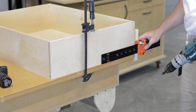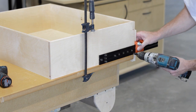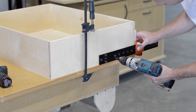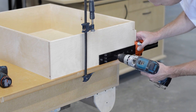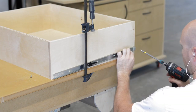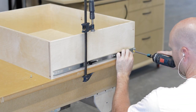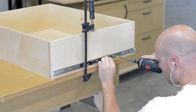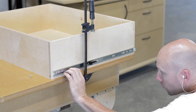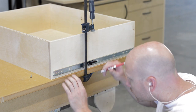It's during this operation that this jig shows its weakness most — it's a little bit too short. With these drawer slides, each length has a different hole pattern, and I can only get two screws drilled with the template. So I have to come back and add a third screw towards the back of the drawer slide, and I locate that third screw with an automatic punch.